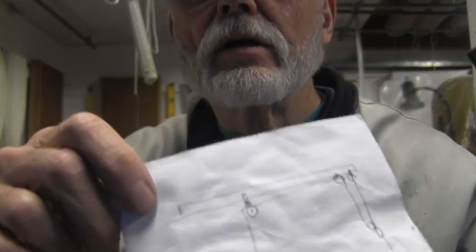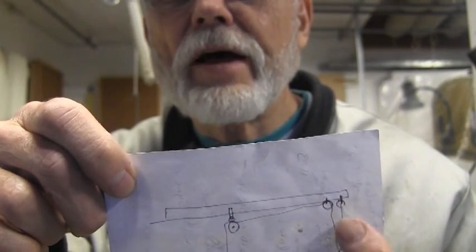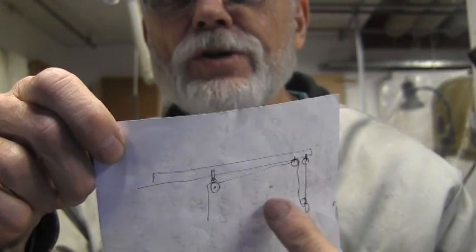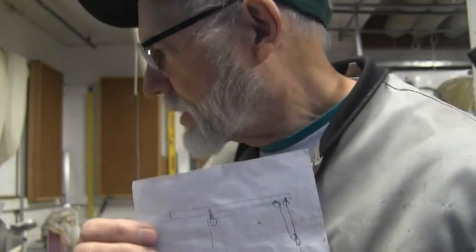For some of these smaller blocks they tend to be oversized, and I didn't like the becket because there was one line coming down and then coming back up and they're real close together. So I was looking through Royce's book - Royce's little Bible, I've got that, must be 50 years old now. I was looking at some of the rigging setups on those boats, and the Snipe had one which had a fitting on the end to tie off, then it came down to the traveler and back up to another block, then off to the mid-boom block. I like the way that has space between the attachment points so the line has a little more looseness of running.